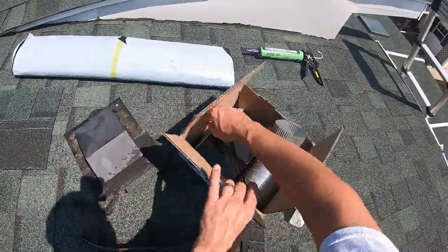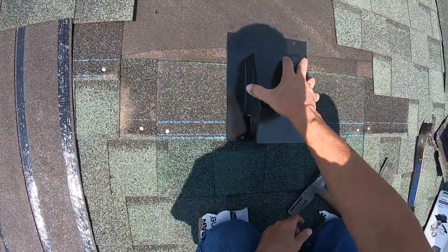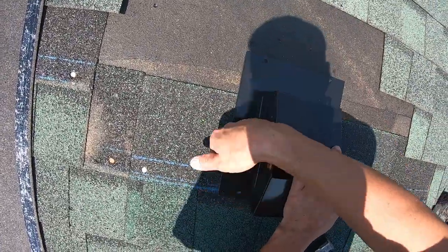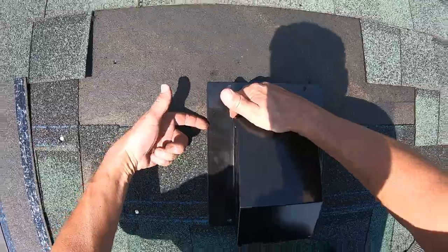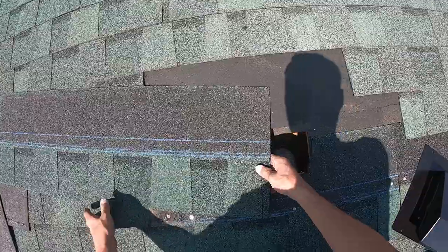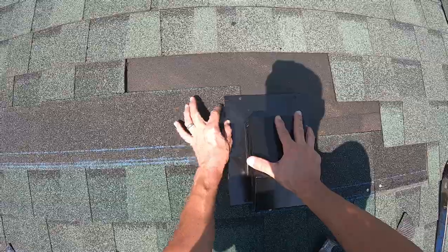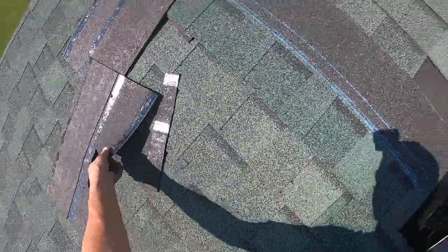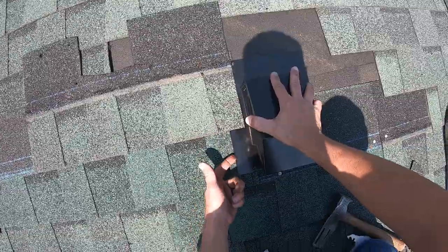Let's look at this height. If you put it down like this, a lot of the flange is going to be hidden — you have enough tucked, technically. But what I don't like is the amount of rain runoff that gets on your flange; you've got that much laterally before it's on your roof deck. If we go under one more on your buildup, you've got plenty more room here, but then you have that much where the next row will cover this — where it could go in laterally under here.